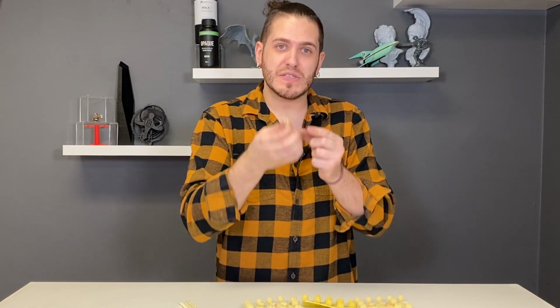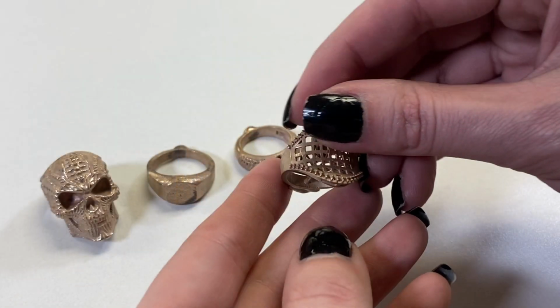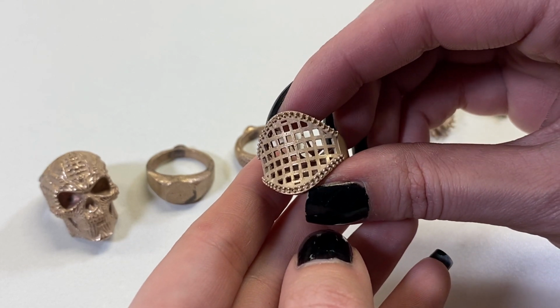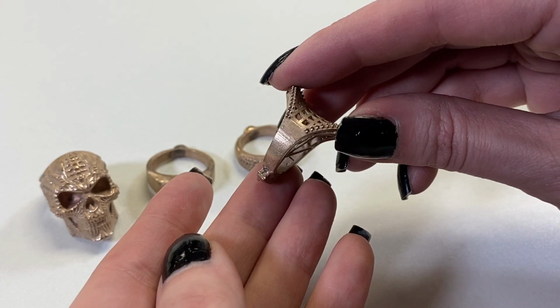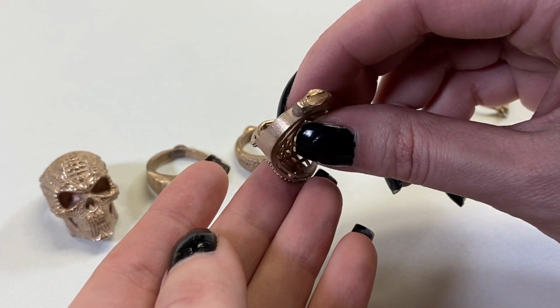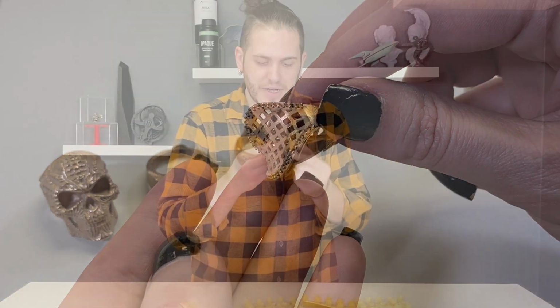All of the prongs and stone settings on the saddle ring turned out awesome. I see a very minor bit of porosity just on the top there, but nothing major. That looks to me kind of like ash, and it could have been related to something else in the kiln or the flask that just fell in, or even during casting. It might have been a little bit of graphite or something. But overall, all the stone settings and all the holes under them turned out great.